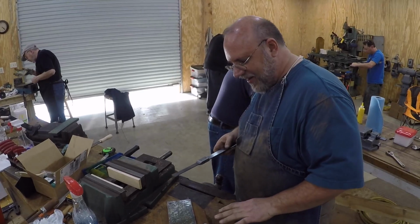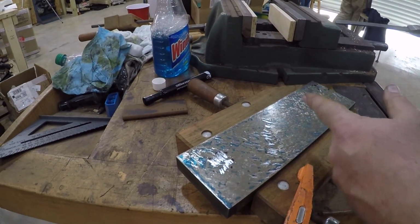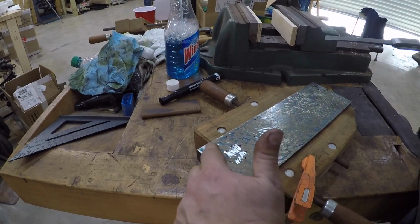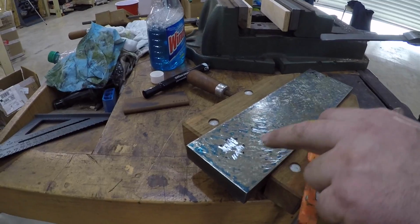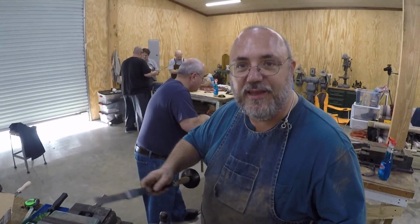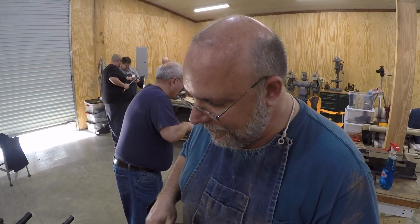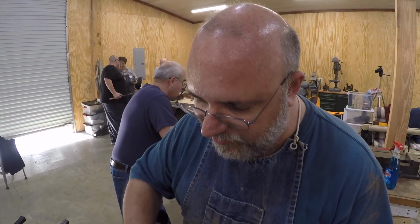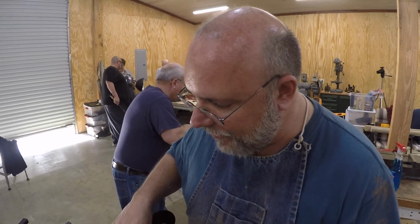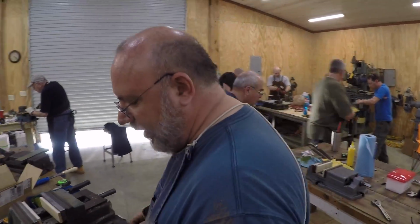It's coming along, man. I've got some blue high spots, and I've already re-scraped all my high spots down to about right in here. I still have a couple in here that I'm working on. I had a couple of high marks. These are my pivot points, where it was hinging. I marked it there, and he told me to scrape those areas twice. I did those first, and then I'm going back and hitting all the rest. Double duty on those.